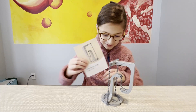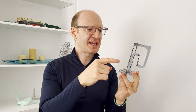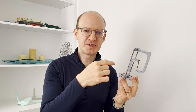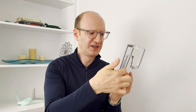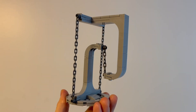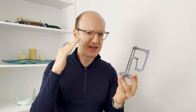Is it magic or is it physics? It's physics. So using physics we can understand that tension and compression have to balance each other out. It's why this structure looks a little odd, because we're used to seeing columns one on top of another, and here we have a kind of a column but then it's going back up this tension and down this other compressive column, and with some of the curves there's some bending as well.